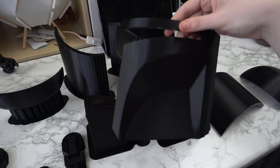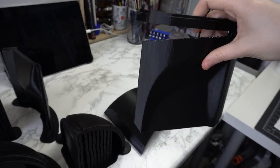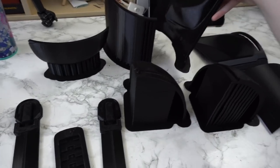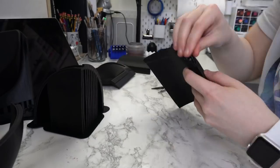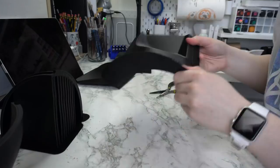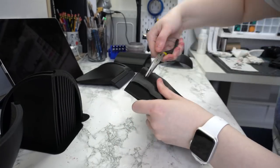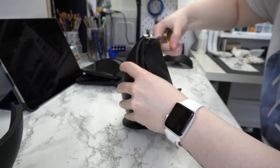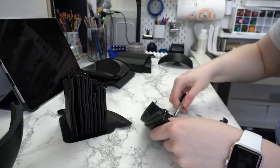This is one of the front side pieces — the visor hole is there. It's super awesome looking so far, but now I have to go ahead and remove the rest of the support material. For removing support material, I just use fine nose pliers. I find they work great for grasping the different supports and removing leftover pieces. I do also normally use a hot knife to burn any extra pieces down to make it as smooth as possible.